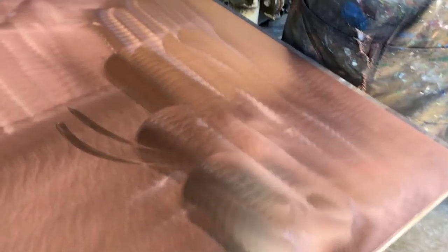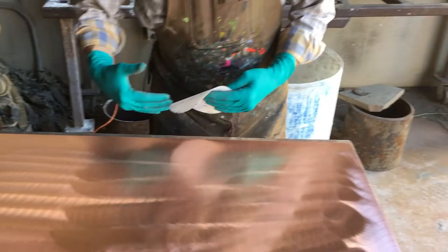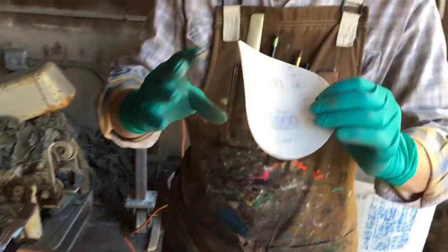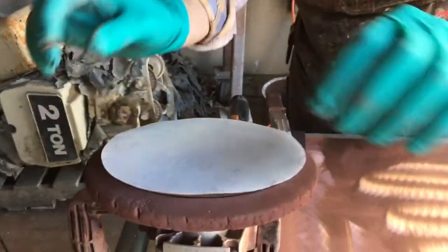There's still a lot of dust on there — that's fine. This is what the plate looks like having gone over it with two 600-grit pads. I started on this side with a new pad, did the whole thing, then put the second one on and reversed the direction, starting in the area where the pad was wearing out and moving to where I had first started. There's a pronounced texture left from the 600 grit, but the grain and the scratches are gone. So now the 1,000 grit goes on, and I do all that again.